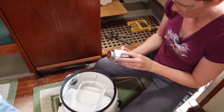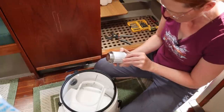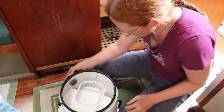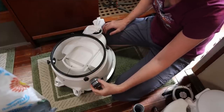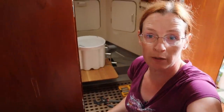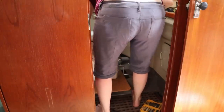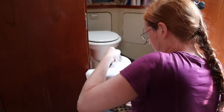How long should it take to set up? Hold pipe and fit together for 30 seconds to prevent pipe push out. Longer at low temperatures. Well, give it a minute or so and see if she sets up. Well, it actually feels like it's set. Okay. So, as I understood, if you recall, I pulled the gasket back. So now we just roll it forward. Snaps into place, and that should help make an air seal here. Let's put that on the bucket. Don't step on the tools and hurt your feet. Oh, it's nice to have that secure. Now, we have to put the liquid bucket in.